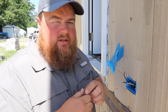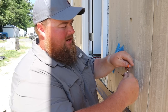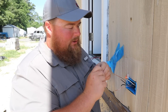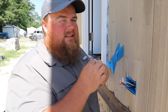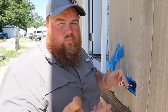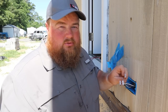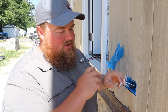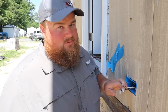For my electrical connections, I'm not using traditional twist wire nuts. We're using more of these Wago lever lock nuts. These are absolutely worth every penny they cost, both in ease. They're great. I'm sure I first saw them on YouTube, but ever since trying them out way back before we ever did any of the house moving stuff, I was sold on them. They are a lot pricey if you compare them to the traditional twisting wire nuts, but for the average person, and even us doing this large of a project, they're worth it. I've had to go back and redo some outlets and junction boxes or troubleshoot, and just being able to lift the lever and pull it off or put it right back down is so much better than untwisting everything, because then you run the risk of making your copper lines brittle, then breaking, then you get your wires even shorter and shorter, and that's just not a good situation to be in.